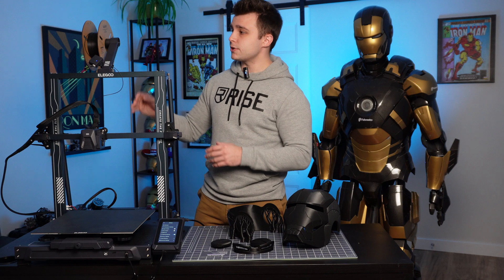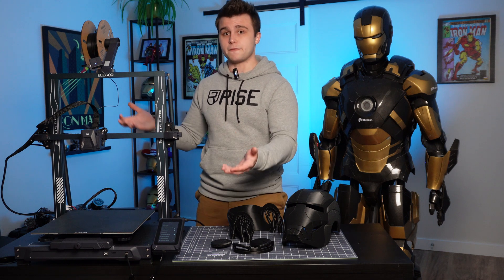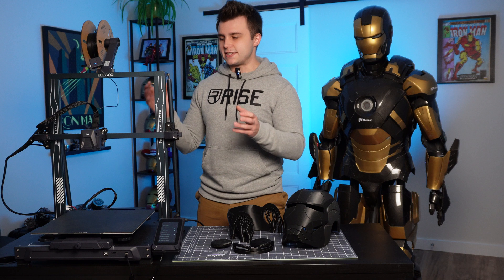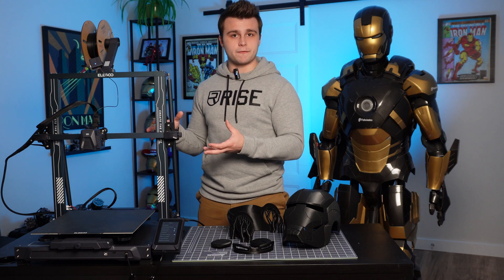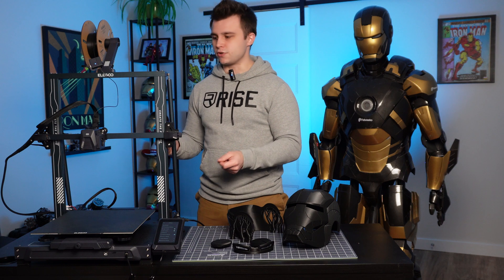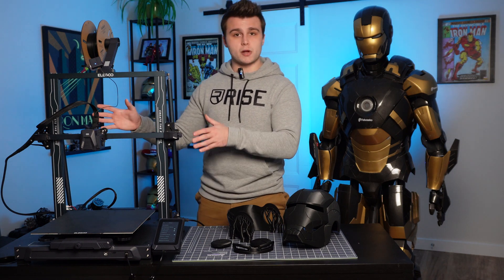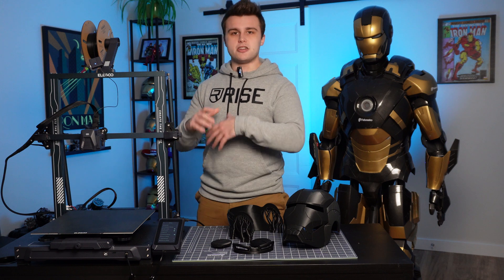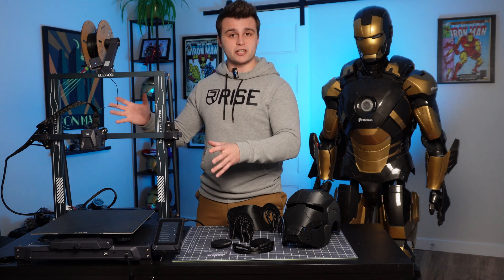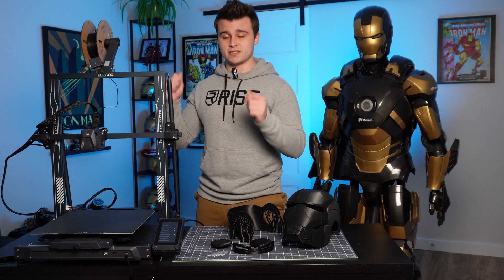We've finally made it to the very top of the printer — we have the filament runout sensor right here. The Neptune 3 series has a really good system when it comes to running out of filament. Whenever this happens, the printer will stop printing, lift the Z-axis, and auto-home. I've had some printers just dead stop in the print itself, and the heated plastic in the extruder will ooze onto the print, causing major issues when the print resumes because the extruder knocks into the cooled blob and topples the print. But this isn't the case with Elegoo's Neptune 3 printers. Once you replace the spool with a fresh one, the printer does a really good job of restarting — the vast majority of the time there is zero layer shifting whatsoever, which is absolutely fantastic.